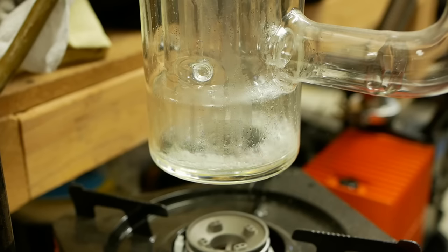You can see the last jet is almost working — there's still quite a bit of condensation happening in the column. In another minute or so that inner piece will be so hot that there's no more condensation happening inside the column, and that top jet will start working. At that point the pump is fully operational and pumping as fast as it can. You can see the lower jets are already working and there's a huge amount of condensing oil here. You can't see the jets, of course, because they aren't droplets — it's actually just vapor. As soon as the vapor hits this cold wall, which is kept cold by the flowing water, it turns back into liquid oil and drips back down to the bottom. And then this last jet is pretty active too — there's a huge amount of vapor coming this way, condensing out here and then flowing back into the pump.